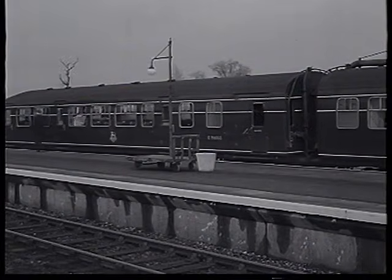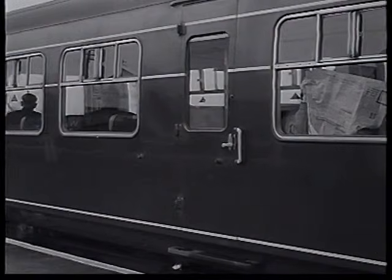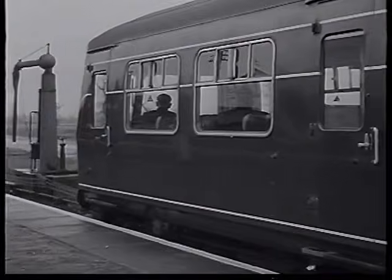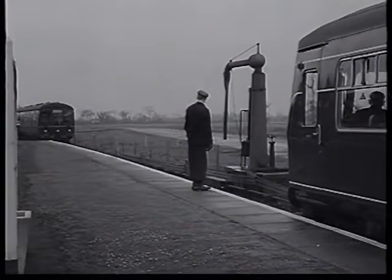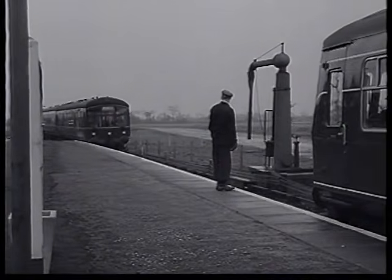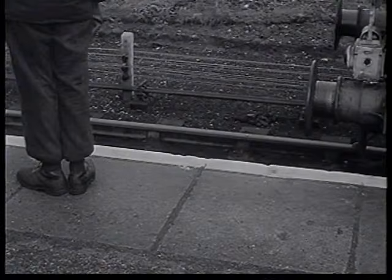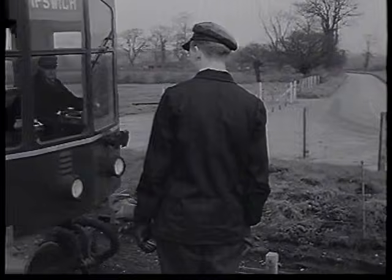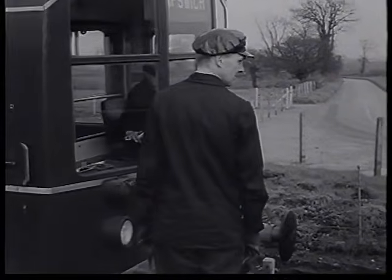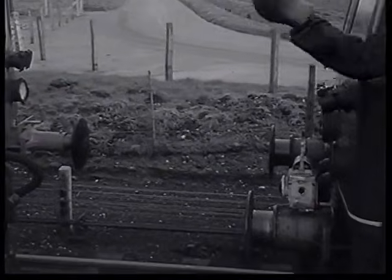If either of two diesel trains to be coupled is carrying passengers, the moving train must be driven and not propelled onto the stationary one. A member of the station staff, or the guard, must always stand as marker, not less than 6 feet behind the stationary train. As the train approaches, it must stop level with him and then proceed only after he has given permission, which must not be given if passengers are about to enter or leave either train.